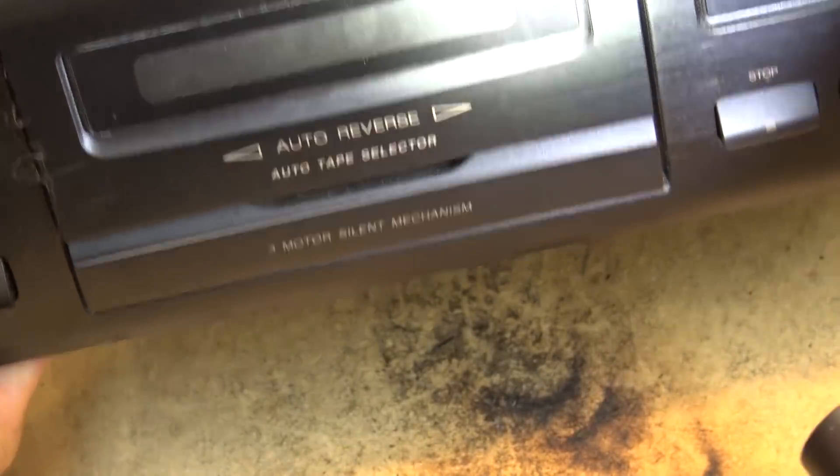I don't know how the belts are on this thing — let's take a look. The belts don't look to be bad, actually; there's a fair bit of torque on there. I think the belts are okay. I think it's just going to be the switches that are at fault. There's only one belt — it's for the capstan shafts — because the reel drive is direct drive. There's one motor here to drive the take-up and supply reel, one motor that raises and lowers the mechanism, and one capstan motor with one belt.